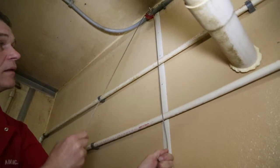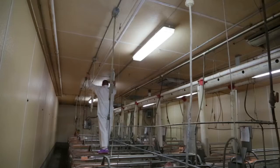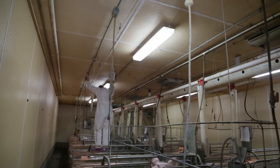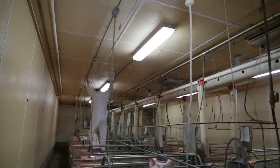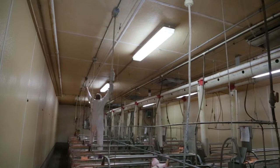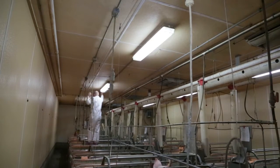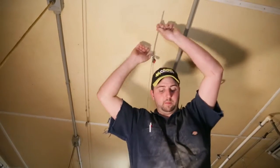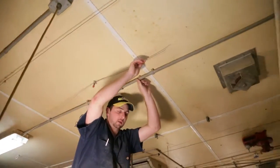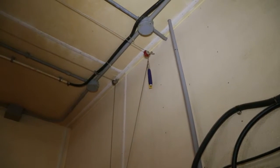Cables attached to the winches must have a clear and open path to the corona pipe. A cable rubbing on other items is unacceptable. Starting at the far end of the barn, furthest from the winch, pull the cable to the pull handle in line with where the corona pipe will be suspended, allowing enough cable to turn at the end of the wall towards the pull handle. The cable provides lift for the corona pipe runs. Pull the cable through the eyes of the pulley supports. Do not allow the cable to rub on other objects. Once enough cable is pulled for the furthest corona pipe run, cut an extra 10 feet of cable and tie or clamp the last to the end corona pipe support.